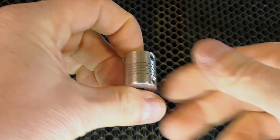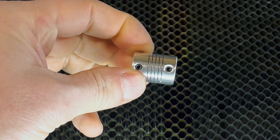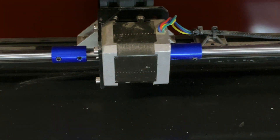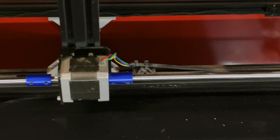Next on the list is the Y-axis couplers. The couplers I chose were the standard ones from 3D printers — those flexible spring couplers. The problem is that when the laser gantry is moving, it's quite heavy, and as it was moving, it was actually causing those couplers to kind of wind and unwind, basically causing a bit of a whiplash effect. I've since replaced those with solid couplers. Of course that means the alignment of all those shafts has to be perfect so you don't end up with weird tension and stress on the shafts — but it was a worthy and fairly cost-effective upgrade. I had lots of metal couplers from designing 3D printers and just stuck those in to replace the two spring couplers. Everything is now smoother and I can go a little faster.